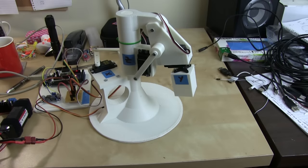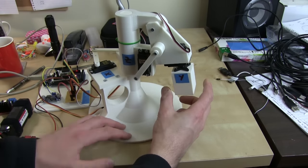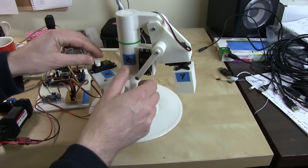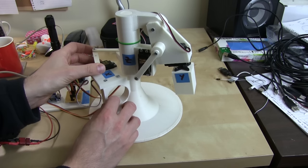Here's the robot arm I built last time — it's currently powered on and stationary because the mannequin on the other side has the inertial measurement unit on its left arm, which is also stationary. If I go and grab one of these joints and try to move it, it's quite hard because the servo is trying to stay in this position. I can move it, but then it springs back — the servos try to hold their position and have a holding torque.